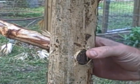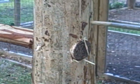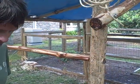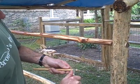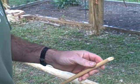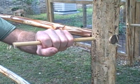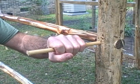Once I got my poles and shaped the end and then drilled, all I'm going to do is use the Amish or Shaker style pegs. Again, there's no nails. I just take a knife and give a little bit of a taper to the end. I'm going to stick that in a hole, and then I'll hammer that in, and that's how the structure is held together.